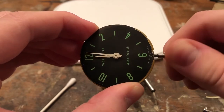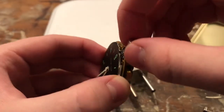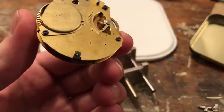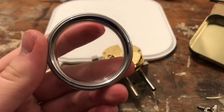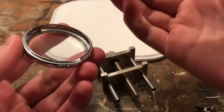Yeah, that's good — that is just fine. You use the button to take the crown out again. There we go. And now I've reinstalled the two little case springs that hold it in the case. Okay viewers, now for the moment of truth — we've got our case handy. There's no dirt in it — it's clean enough. Stick our movement in — well, upside down for literally everything that isn't this.